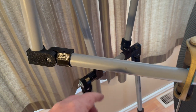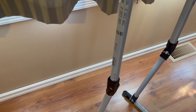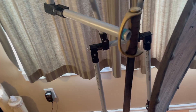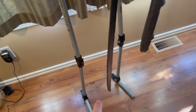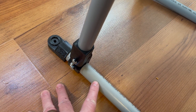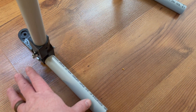I'll include all the measurements I use here. This is about a six-foot-four armature. Coming down here, the knees are bent — why? Because it allowed me to start loading up the actual armature with weight, and with the knees bent it strengthens the whole thing up, just like a human body. You'll be able to pose these exactly where you want them. Down here on the foot, I put an extra bolt right through because there's a lot of torque on this. This should be screwed down to a board to give the whole thing stability.